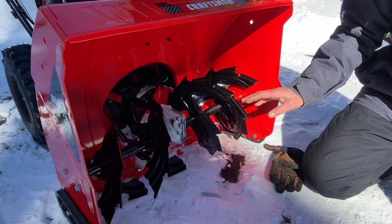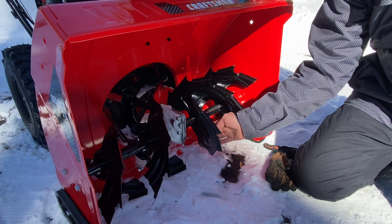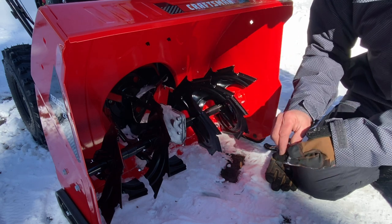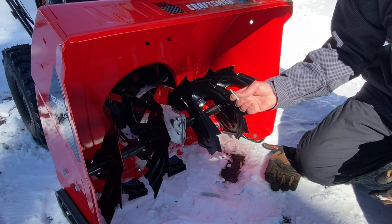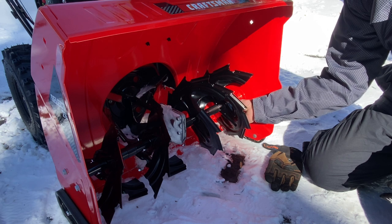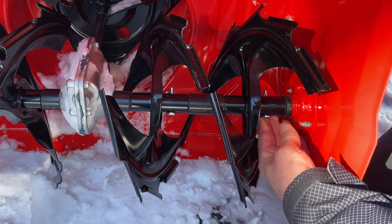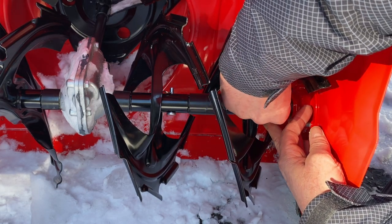When I was using this yesterday, towards the end of the project, I broke one of the shear pins. The shear pins are here — the shear pin will break if you hit something like a chunk of ice or newspaper, instead of your gear box breaking. This is a much simpler repair and this machine came with two extras. To replace the shear pin, if it's stuck you might have to use a punch to get the old one out. This one wasn't stuck, so I just find the hole, feed the pin through, and in this case use a pin to lock it in place — sometimes it's a bolt or nut.